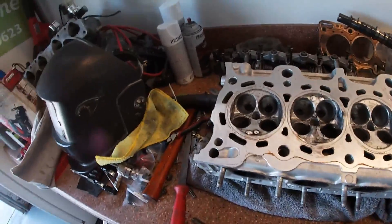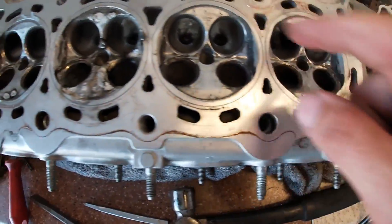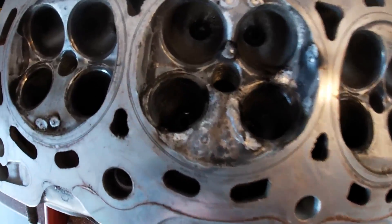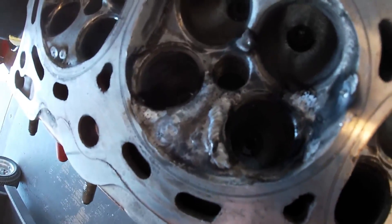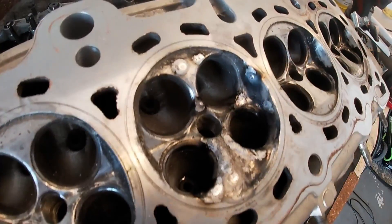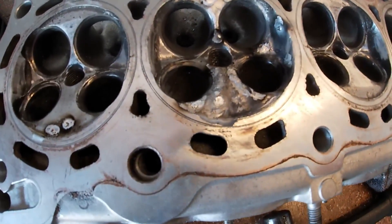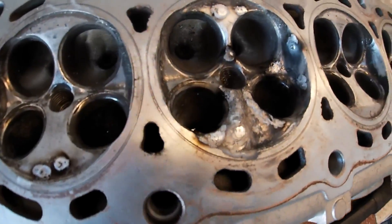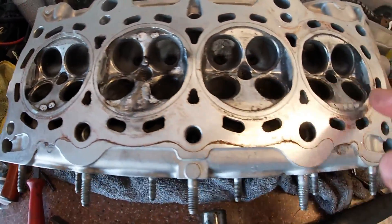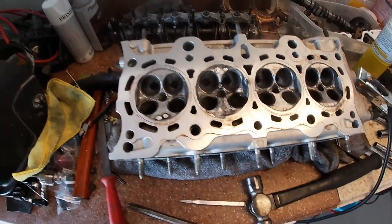Alright, I did end up filling a couple of these other ones, and I'll probably come over here and do a couple of these other little guys too, but we're getting pretty close. We got it built back up well. There's a little piece of the tungsten that got stuck inside — I'm going to knock that out right now and then clean it up a little bit and see if I need to go back over anything. I'll probably come back and grab some of these other little spots, but for now it's looking pretty good. Let's see what it looks like when it's all cleaned up.